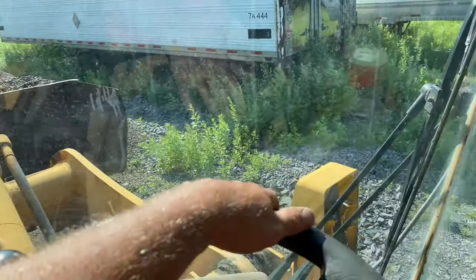It only took us like a day to do this. We worked about half a day yesterday and maybe a little more than half a day today. And that's what it looks like. So I got tubing ordered from Supply House, some oxygen barrier tubing, half inch, and that's what we're gonna use for our radiant heat. And that's it. See you in a little bit. All right guys, we are putting some tubing down in our mono slab here.